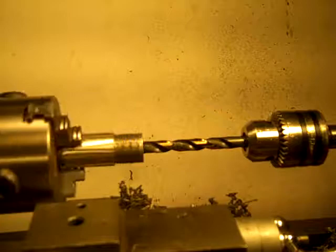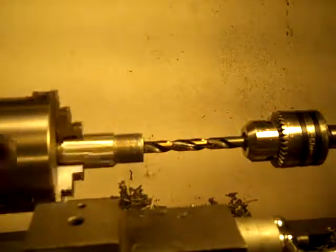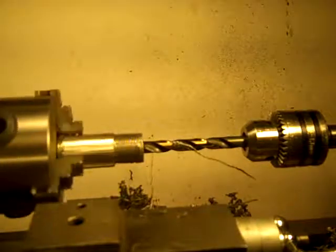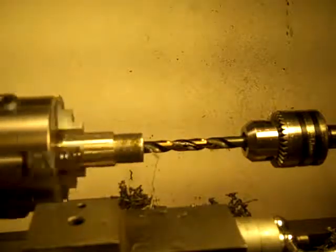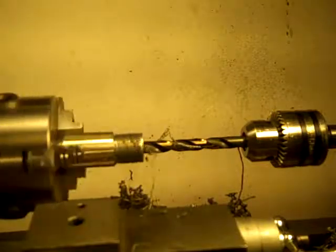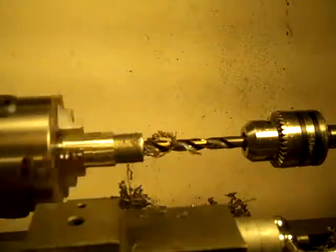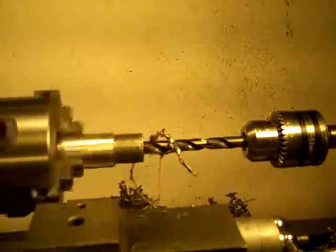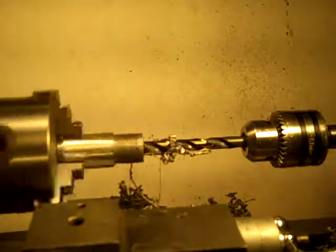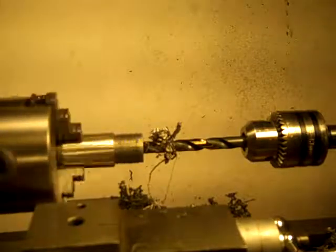You may notice that I have gone in far deeper than the length of that bullet. That's because I'm going to be making a ram that goes right inside the hole, follows it right inside, pushes it right inside. When I'm done with this, I'm going to take a two millimeter drill bit and drill a through hole through that bolt — two millimeters — and that will be for an extraction pin.